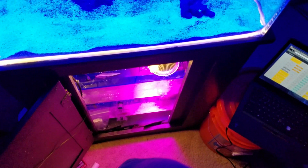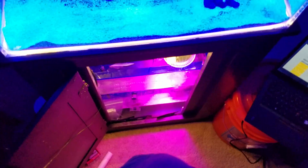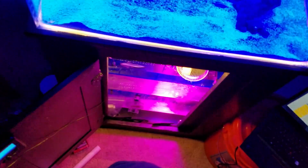Whereas in this setup, I do have one switch that's basically set at that level, which is the low switch. So when that bottom switch is down, if there was something to pump water, that would be it. But of course, right now there's nothing. It just alarms. But alarming is good. Alarming means I can pay attention to it.